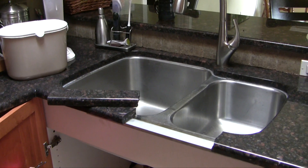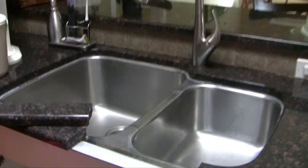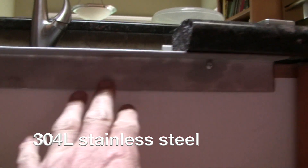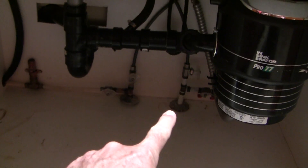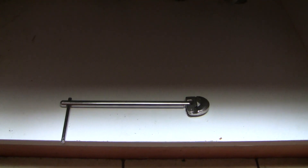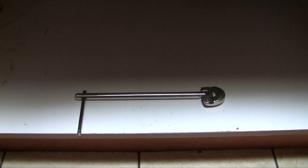I need to glue that broken piece back into place. Fortunately it seems to fit pretty well. In preparation for that I've bought an inch and a half piece of angle iron and bolted that in to give myself more of a base. I've cleared the sink underneath and now I'm going to turn off my hot and cold water access, open the tap so there's no water in the lines, then crawl underneath and use a basin wrench to undo the nut holding the taps solid against the granite. That should allow the granite to be mobile enough that I can shift it around properly.